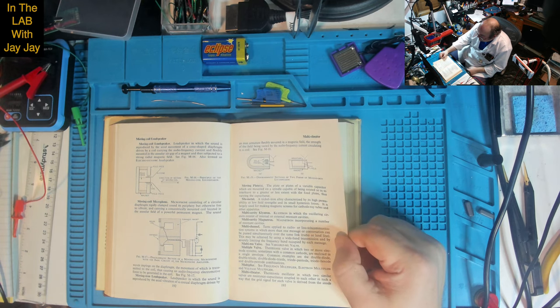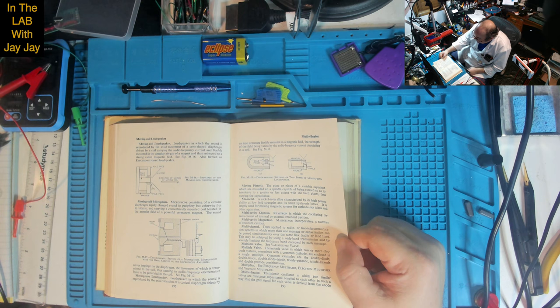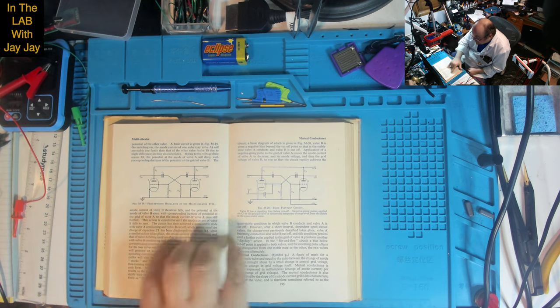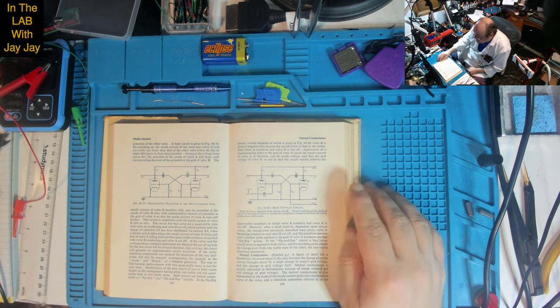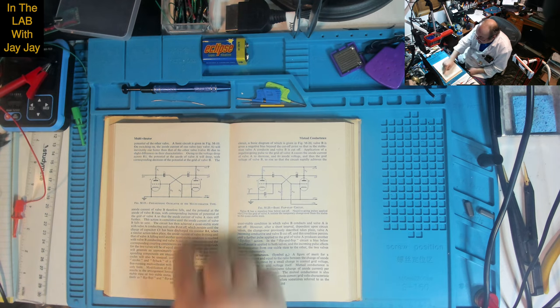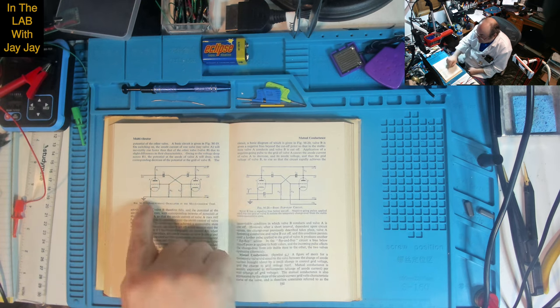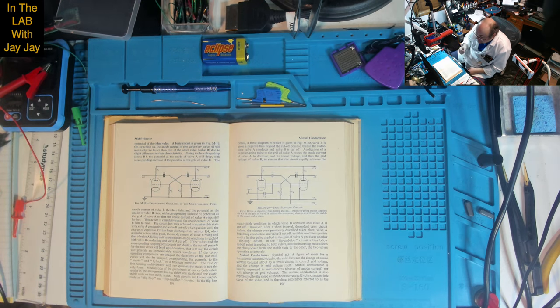We've just been dealing with multivibrators on our channel in the last couple of videos. This one won't be the same because I don't think they had transistors in 1963. So the multivibrator: thermionic oscillator in which two similar valves are resistance-capacitance coupled to each other in such a way that the grid signal for each valve is derived from the anode potential of the other valve. Look at that, you can literally see the circuit there. That's great. I won't go into all the details here because this goes into great detail about the multivibrator. But doesn't that look basically like what we know? You just switch out those valves for transistors and it's the same thing.